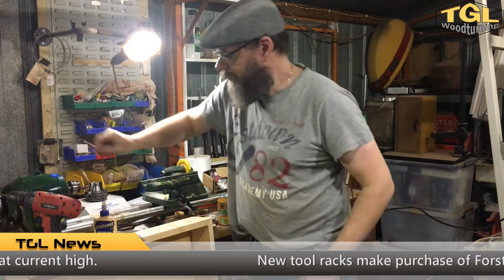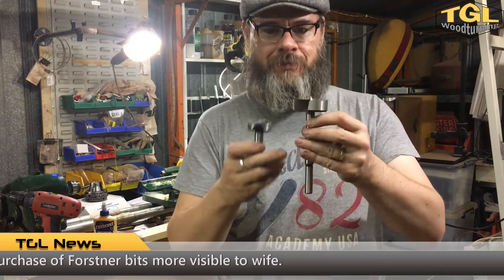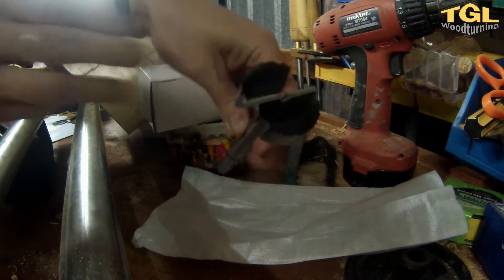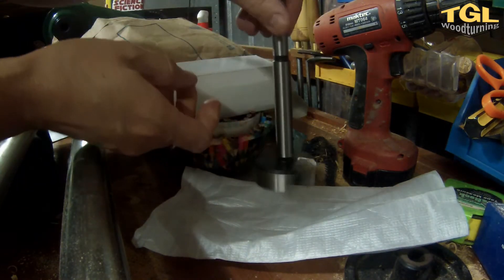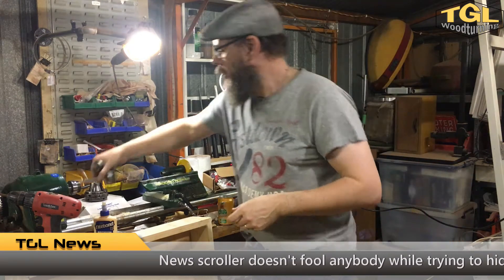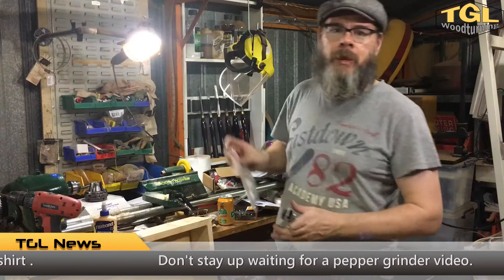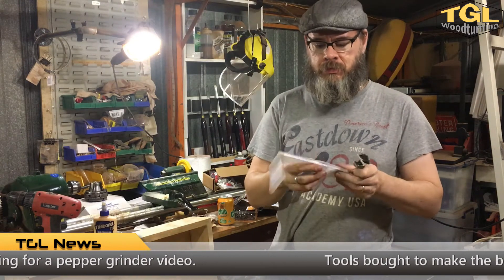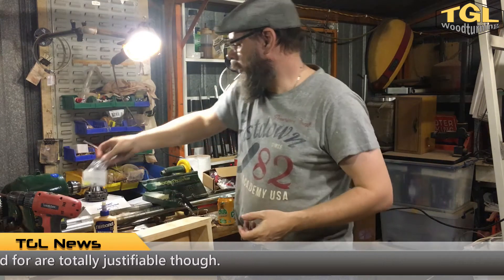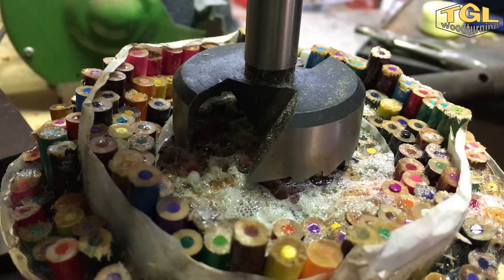So what I've done is ordered myself some new Forstner bits. A couple of larger ones here — this biggie is a two and a quarter inch Forstner bit. No metric system stuff here, this is serious imperial. This is to put mortises into things I can't get up on the lathe; I'll do that in the drill press. And a smaller one — this is a one and five-eighths inch. That size is required for a pepper grinder kit I bought some time ago. These came in the mail this week, and they're going to enable me to put a mortise into the back of the pencil bowl so I can start turning it.